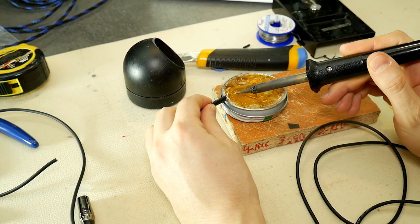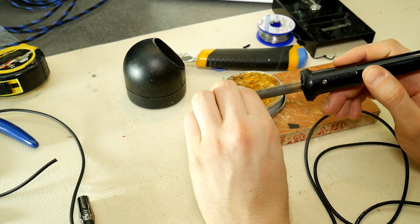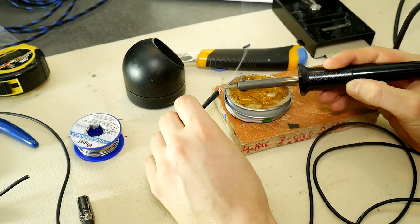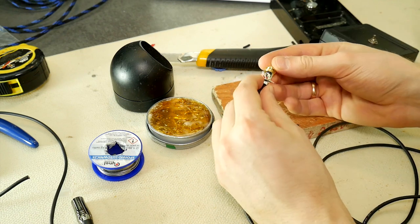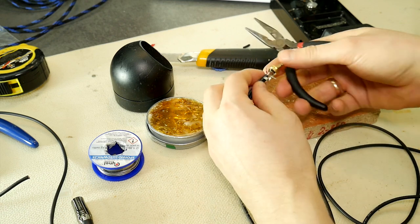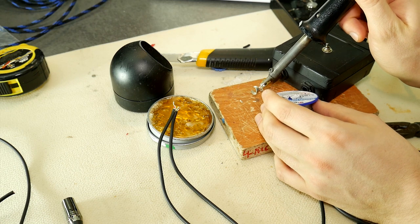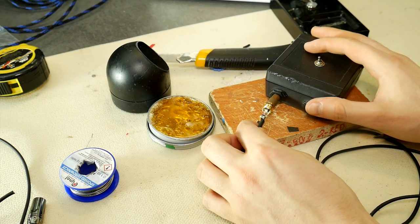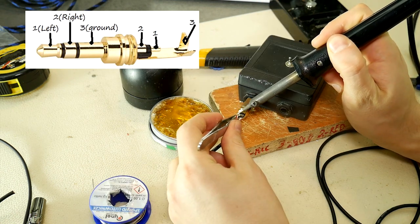You must be at least 18 years of age or have parental permission to take the next step, as soldering is dangerous and intended only for real men. Your task is to solder the ends of the wire to facilitate further operations. Take the 3.5mm jack and fit it for our dual cable, checking that the pre-prepared wires are long enough to solder. If necessary, trim the excess length. Tin the 3.5mm jack contacts so the new wire can be soldered more easily and with better quality. Insert our dual wire and solder the wires: the first pin is left, the second pin is right, and the third pin is ground.